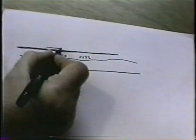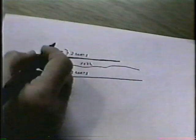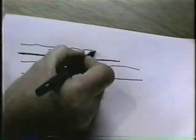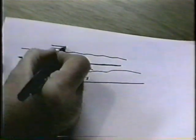And I'm going to put 3 more coats brushed on of light coat. At this point in time, this should start to look a little shiny. And I'm going to sand it down because, again, the surface is swelled and shrunk. It's going to look a little lumpy. I'm going to try to block sand it down. And I'm going to put 2 coats on of talc filler.